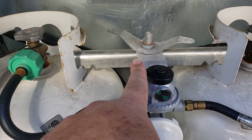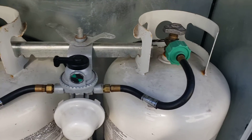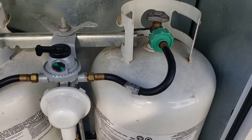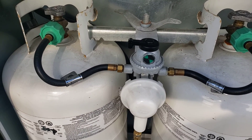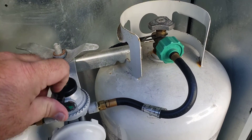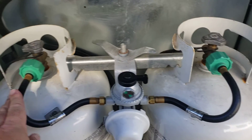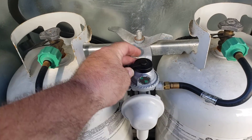See how the little thing here points to that side? So you don't have to get out in the middle of the night to turn on your propane if it's freezing, because it automatically switches over. But then you check that, and when it shows red, you can flip this to the other side — it's running off of that side — and then you can take this one over here and get it refilled. That's very convenient.